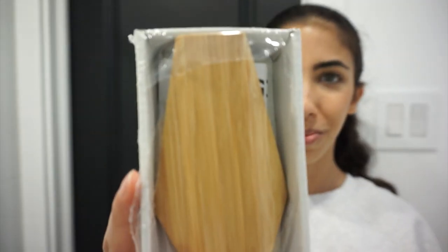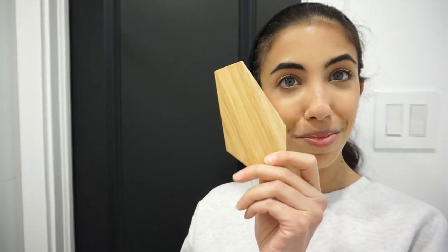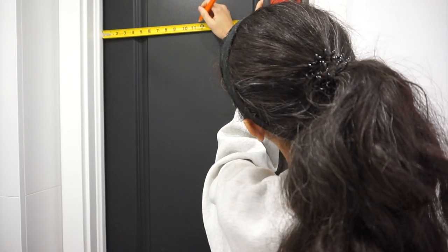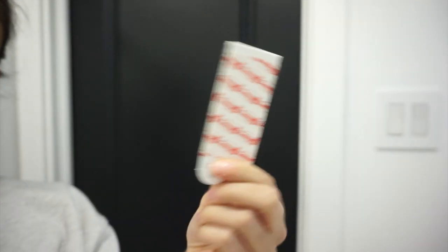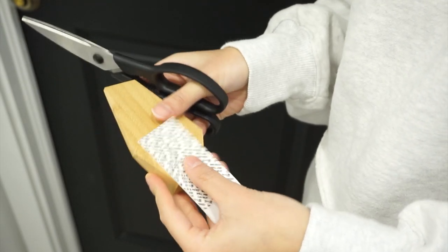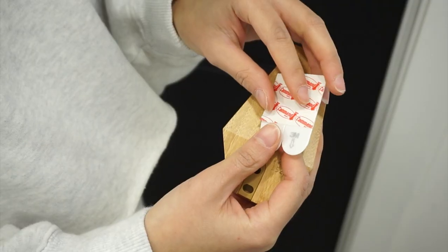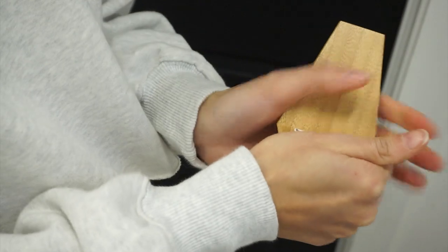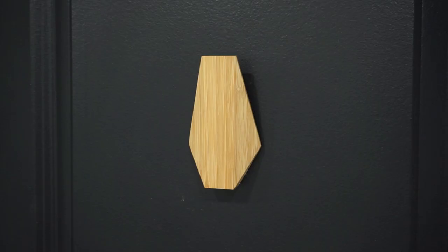Hanging hooks on the back of the door isn't simple because a lot of doors are hollow core — just a wooden frame with a thin quarter-inch sheet of plywood and fully hollow after that, so even an anchor won't do much. To solve this I used a command hook from Amazon, but I'm only using the tape that came with it, not the hook itself. This is also a great tip for renters. I cut the tape to size, cleaned the surface with alcohol, and pressed the hook to the door, then trimmed off the little pull tabs with an exacto knife.